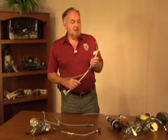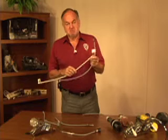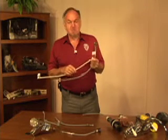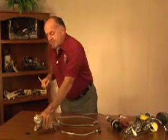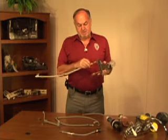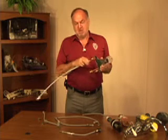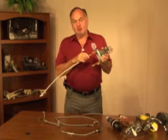Polybutylene supply lines often have preformed ends called bayonets. These ends are designed to fit into faucets and receivers to provide a watertight seal. An example of that type of seal sets with a half inch brass coupling nut. Once that's tightened, that polymeric bayonet on the end will provide a watertight seal.